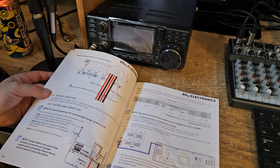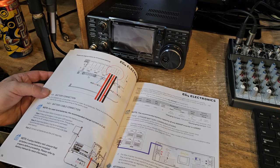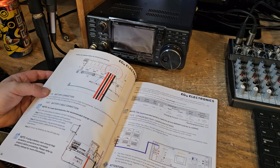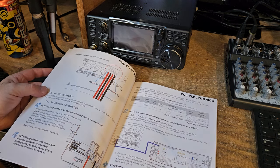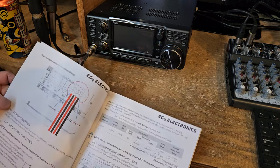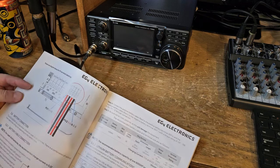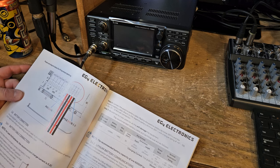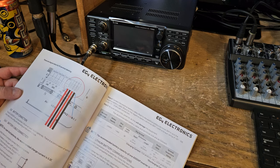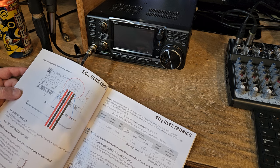Place all breakers in the off position before connecting and disconnecting the wires. Ensure there is no DC voltage present on the voltmeter. Assemble the ring terminal based on the recommended battery cable and terminal size. Connect all the batteries of the unit required. Blah, blah, blah. So basically, they say maximum amperage 140 amps, battery capacity less than or equal to 200 amp-hours, battery wire size 1 AWG.